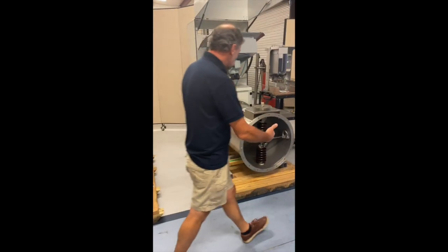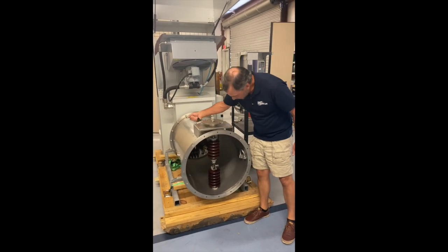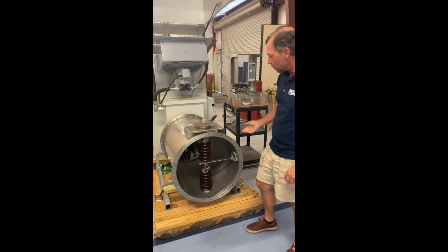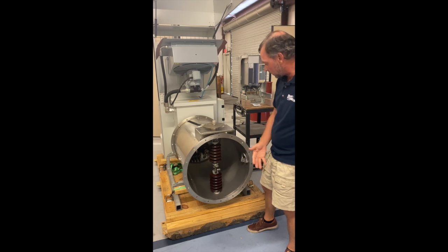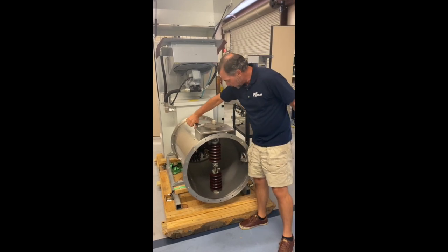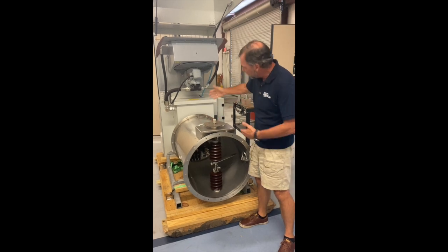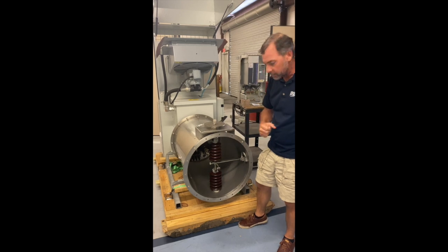We have another which is somewhat common out in the precipitators, not as common as that, but this one does one extra step. It's connected to the high voltage, to the precipitator — this is a switch mode power supply. As we move the switch, it disconnects the high voltage from the high voltage power supply and grounds the precipitator.